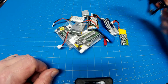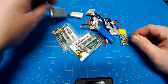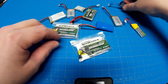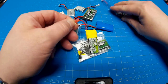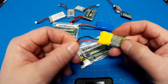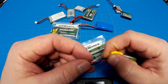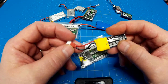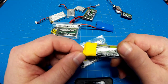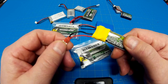Now it doesn't operate right. How that happened - I got too excited and I had some batteries I hadn't used before. They had reverse polarity on them and I plugged it in - magic smoke, just a quick puff - quickly unplugged it but damage was done. The board does kind of work but it's not flyable; it yaws heavy left and only gets worse the more throttle you give it. So that one's done - ordered a new one.